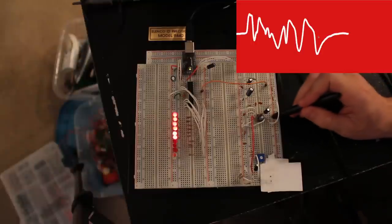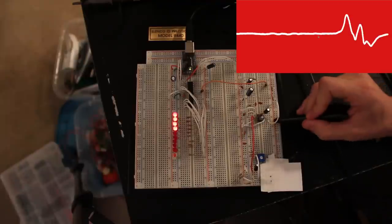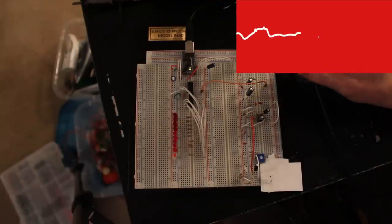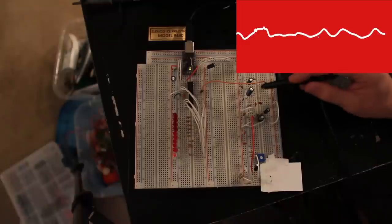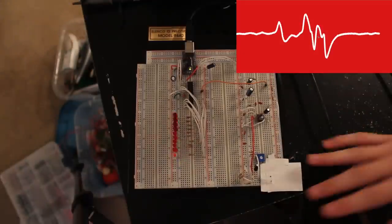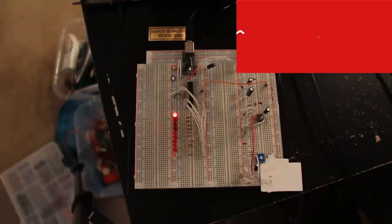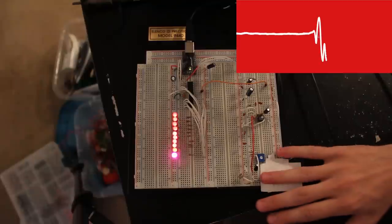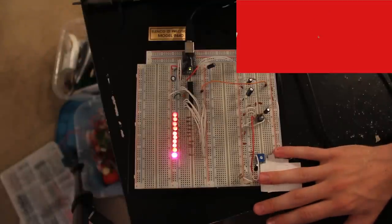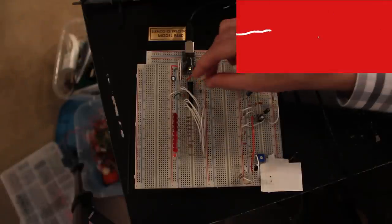This was directly from my whistle detection circuit. It goes into the LM386, then through a two-stage low-pass filter. The corner frequency of each stage is about 16 Hz, which is perfect since your heartbeat is slow. One thing to know about ambient infrared light is that it contains a lot of high-frequency content, so the filtering is important.